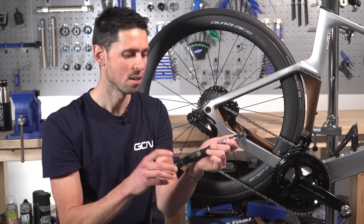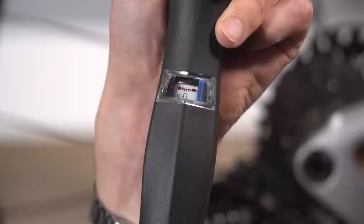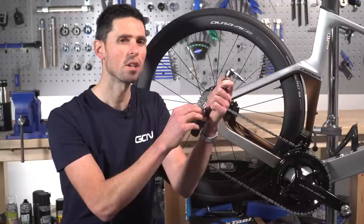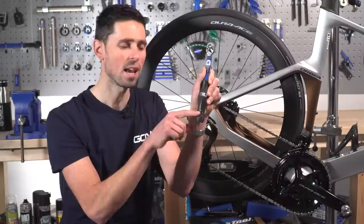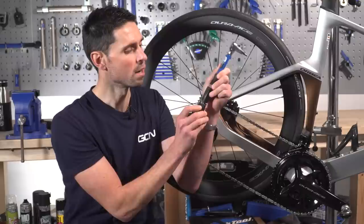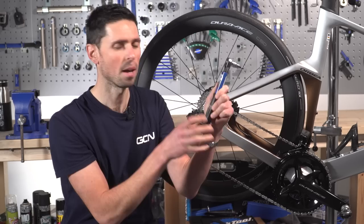To do that, we've got a little indicator or scale on the handle of the torque wrench itself. We press the bottom part of the torque wrench up because it's spring-loaded and then turn until we reach the relevant number on the scale or chart. Now, this goes up in increments of two, which means I need to use the scale on the section of the handle that turns to finalize and get the torque setting exactly right. I can set it all the way around to six newton meters, which means this part is on zero, then continue to turn it all the way around until I reach the extra one. That means it's set correctly. I can then go ahead and put the torque wrench and the socket into the bolt.